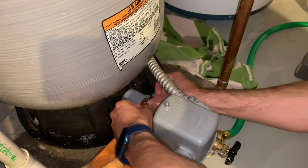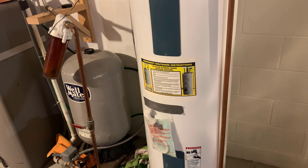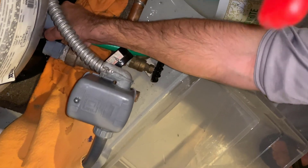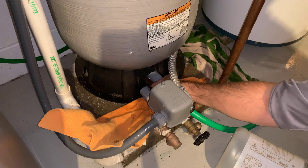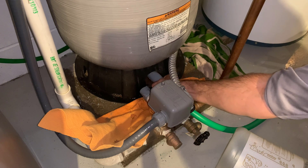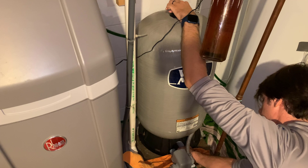There's some gallons in there. Now I should be able to just pull the whole thing out — but that still has a lot of water in it. I might have to let it drain completely just so I can lift it. Letting air in the top actually does speed the draining up quite a bit. So what I should have done is let the air out while I had the hose open earlier — you should do this before you take a hacksaw to the pipe.